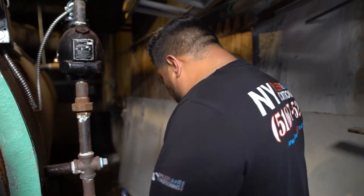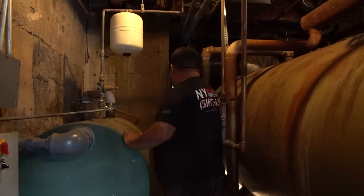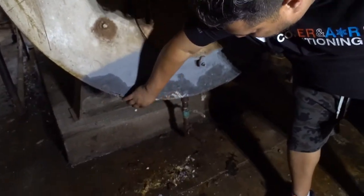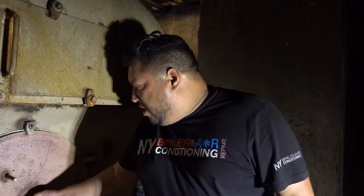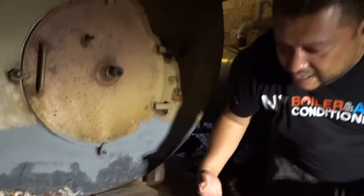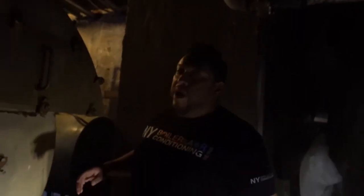We're talking about the leak but nobody's telling me exactly where. I can see corrosion on this side and on the other side too, but you can't really tell. I see indications of a leak but I cannot 100% pinpoint where they're coming from. The boiler is in bad shape as far as deterioration — a lot of rust, a lot of joints. This is all calcium deposits from water. I'm going to open up this door, get my tools from my car, and see if there's any water inside. It's a tube boiler, so the tubes may be leaking — we don't know, but there's definitely a leak. You can see it's all rusted, and inside you can see water all over the floor. Granted it's humid, but there's definitely a leak somewhere — we just need to pinpoint where exactly.